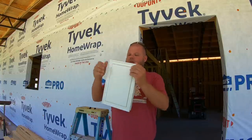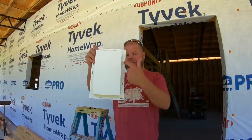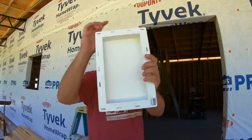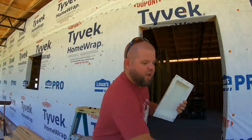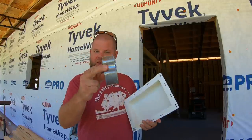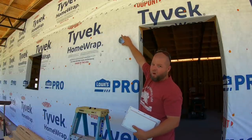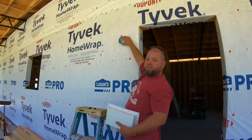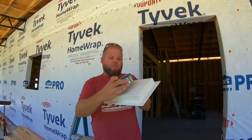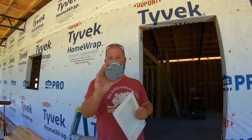It has a cover that pops off the outside, a trim plate. And you're left with a nailing flange, and I could seal this up really nice for the penetration through the wall. The other nice thing about this is it has these circles in here that just so happen to be knockouts or cutouts for a 4-inch box. And this is your standard 1.5-inch box. It looks like if I were to figure out exactly where I want to mount the base of the light here on the wall, mount this here, run my wires in it, get this nice and sturdy, this will go right over it after I cut my little cutout or knockout, and the box will sit perfectly flush with this. So it looks like it was intended and designed to work with a 1.5-inch box.